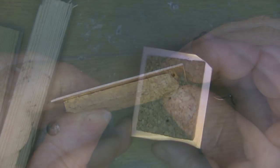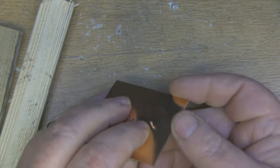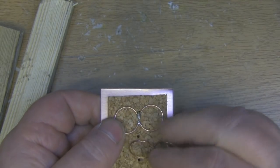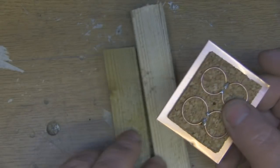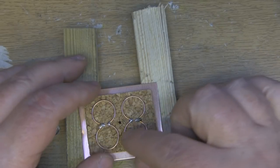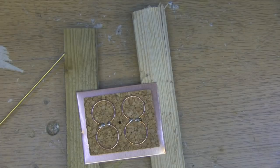I've got my cork super-glued to the reflector and drilled holes all the way through. Now if I get one of the elements, the leg pokes through just enough for me to get some solder on there and snip away any excess. I'll place both elements onto the cork, hold them down with masking tape, and use a couple of pieces of scrap wood to support the protruding legs on the back. Then I'll cut a piece of brazing rod to length, solder that cross-piece in place, and lift everything out using the reflector as a jig.